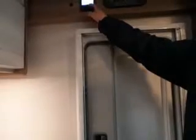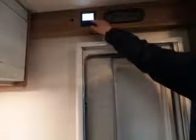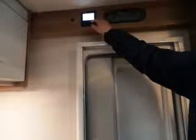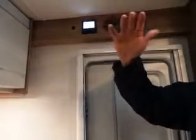Okay. And your last bit is a little spanner in the corner. That's a further menu: index of what's happening with the unit, brightness of your screen, language if you want to talk French or German to it, reset if you have any problems with the system, and offset. As you were saying before, it's thermostatically controlled, so if it thinks it's 30 degrees in here and it's obviously not, it's a lot colder, the thermostat won't allow the heater to come on, so you use that to calibrate it to bring it back to roughly what the temperature actually is. That's good. Happy with that?